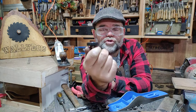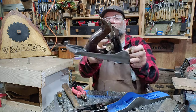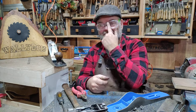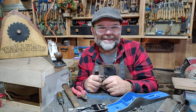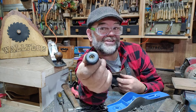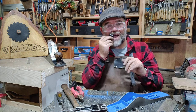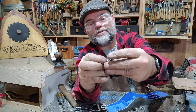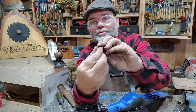You must lube your tool — that one has already been lubed and cleaned up. At first I thought this knob was just plastic, but this is a wartime effort and during the war there were shortages of materials. Brass was traditionally used for the adjuster knob — that little wheel there is brass. Some later ones were plastic, like the Stanley Handyman hand plane. But this one isn't plastic — it's Bakelite. You remember the old Bakelite radios? I can tell it's Bakelite because it's really hard — not like plastic which has a dead sound to it.